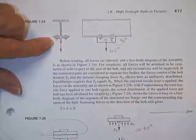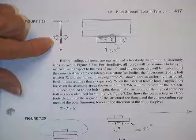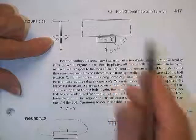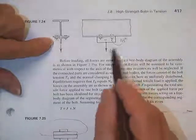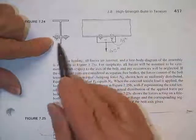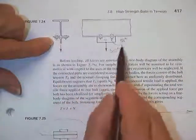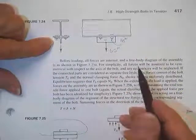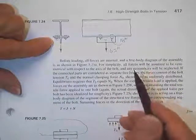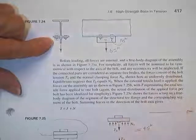Some of the bolts — if you remember, we had a table which told us how much tension they require us to put in them. Maybe 18 kips. Maybe you have 65 kips of load and four bolts in all. As long as the load goes into the bolts and the bolts aren't overstressed, I'm not too worried about it.